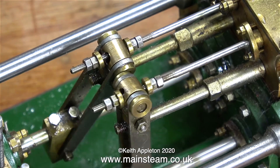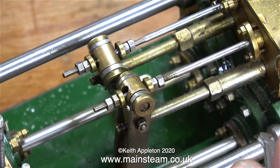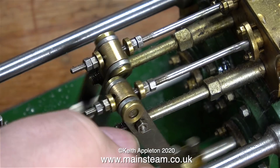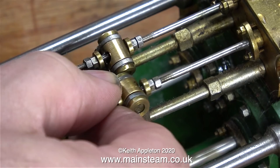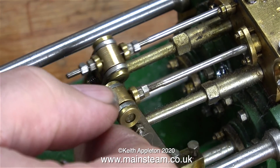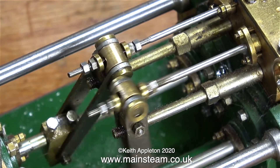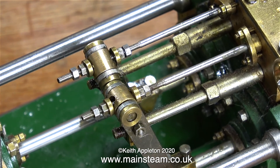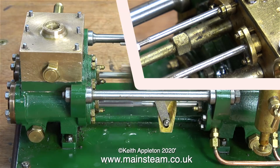That's a lot better. It's still skipping a little bit at lower speed, but then again I haven't adjusted the valves — as you can see at the top they're not the same at both sides. These valve spindles must not be tightened up against the parts that move them. For this pump to work correctly there needs to be quite a lot of float between the operating arms and the nuts and washers on the valve spindles. As I said earlier, I'm not going to finalise the timing — I can only really time this engine when it's pumping water. But as you can hear, it's now starting to sound much more metronomic and far better than it was about an hour ago.